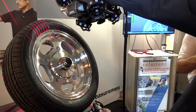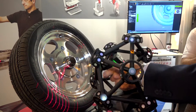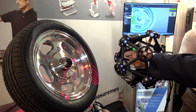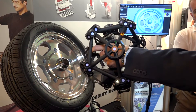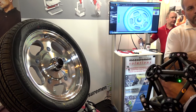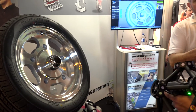I'm going to scan around the tire. And as I'm doing that, on the screen in the background we're seeing the part appear automatically — it's completely live. That's scanning at a very high resolution, down to 50 micron resolution, so it's a very high resolution scanner. All I need to do now is stop the scanning, go back to the PC, and now I can let the process calculate the surface, and within 30 seconds we have a surface.